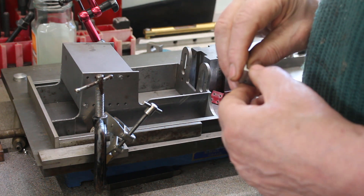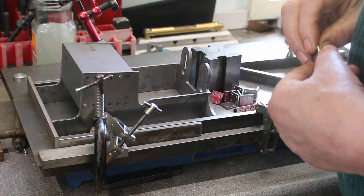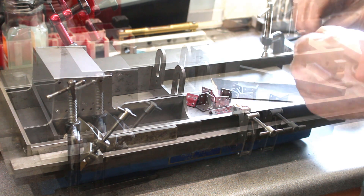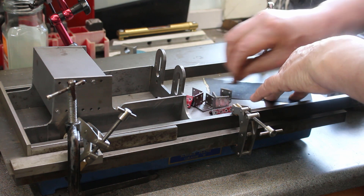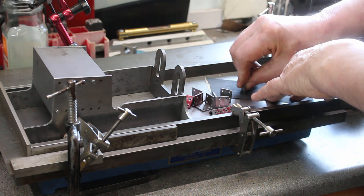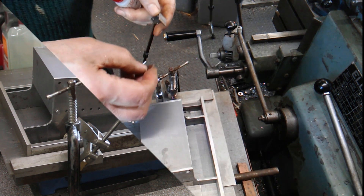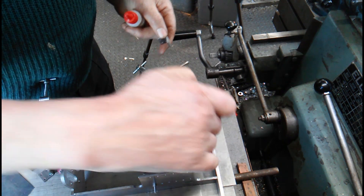The frame is probably going to have to be assembled and disassembled a few times throughout the process of building the engine. I'm just cleaning up these brackets as I go, removing some of the machining marks to generally make them look better — they'll have a good clean up before I finally fit them. The bracket needs to be raised a little bit above the surface plate, so I've made a little 0.7mm spacer.